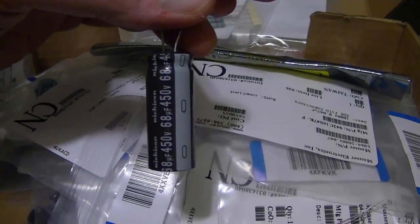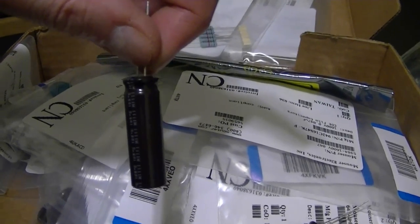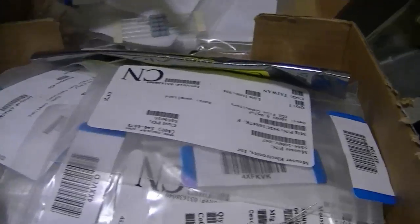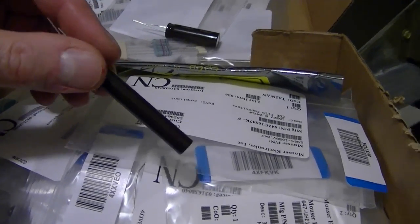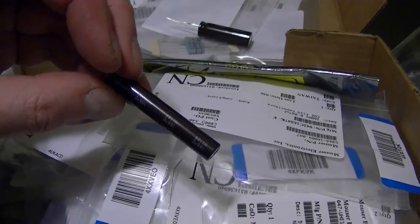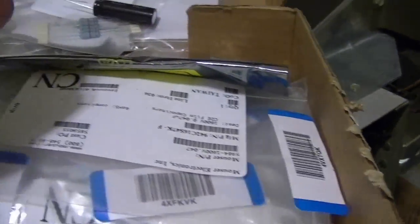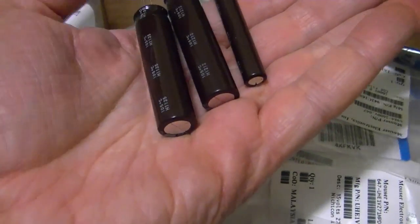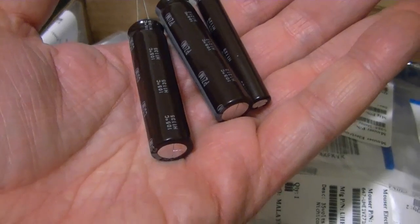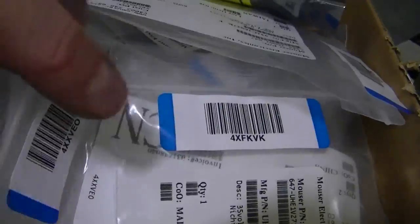Here's a cap I might have used 3 or 4 years ago, and they then came out with the same thing in a skinny size but with similar if not better ratings — high temperature, long life. Well, now check this out: they call these pencil caps, and they have fantastic specs. Not only 105 degrees Celsius, but really, really long life — 10,000 hours and really high ripple current. A little expensive, but less than a Sprague Atom would cost. Now they don't have a huge range of values — I think the smallest you can get is 18 microfarad, and they only come at 40 or 50 volt flavors. So I only got a few of them, and for the other caps I got more conventional ones, but they're still skinny.